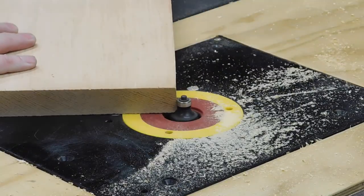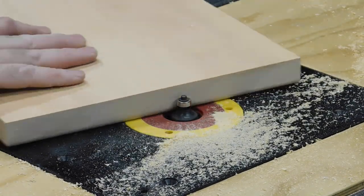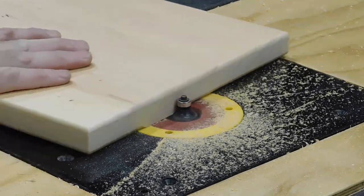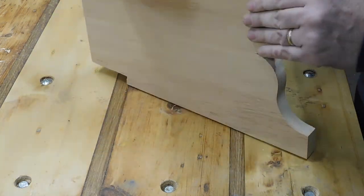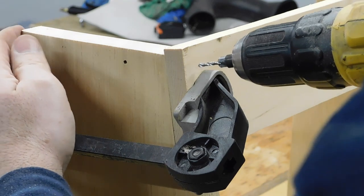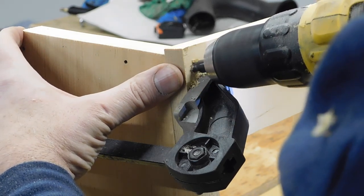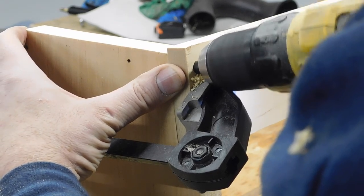I then go and round over the top of the bench. I like to round over both the top and the bottom side — at this point I don't know which is the top or the bottom; I gotta see which one stands up nicest. Now this is going to be my first big deviation from Rex: he uses cut nails for an authentic look. I will be using screws, and I will be covering those screws with dowels.